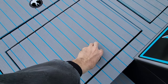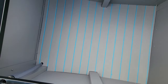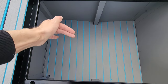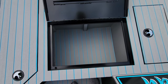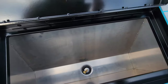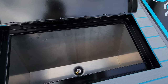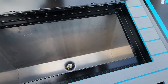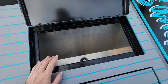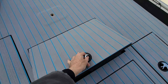There's also a storage hatch with paint work done inside all the compartments. Drains run through the subfloor to a channel directing water to the back of the boat. Turf in the bottoms and hat channel underneath the lid. Over here I did a cooler — custom made, with the back tapering to mimic the outside shape. It's got foam all around; not a Yeti, but it holds ice pretty well. There's a drain in the bottom that goes out the side of the boat. Not the most massive cooler but makes good use of the space.